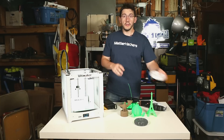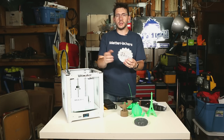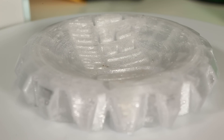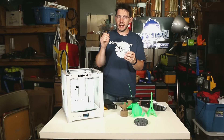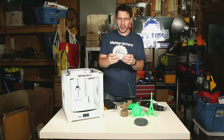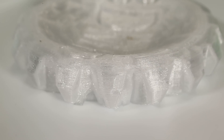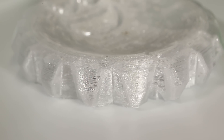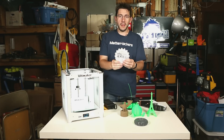The last model I wanted to show you is this MakerCoin using Angus from Maker's Muse's three-dimensional lattice infill. This was printed with Colorfab's HT material and it's a great material — it's got a good translucence, it kind of glows and shimmers because of the way the material interacts with light. This material will grab on to your glass build plate; I highly suggest adding PVA glue to guard against it, because when I removed this coin it took tiny bits of the glass bed with it.